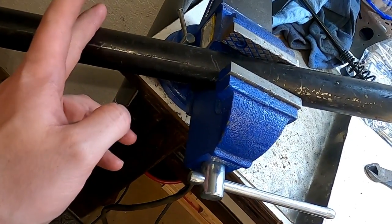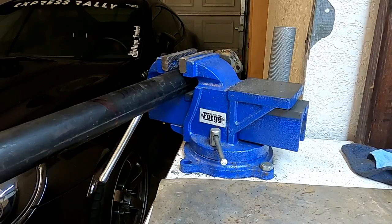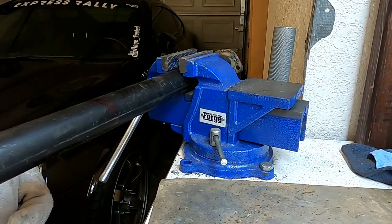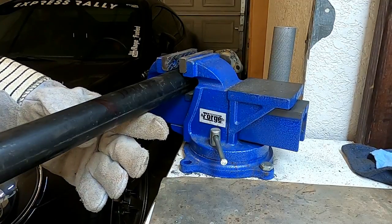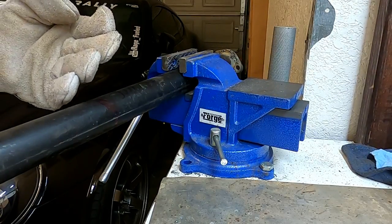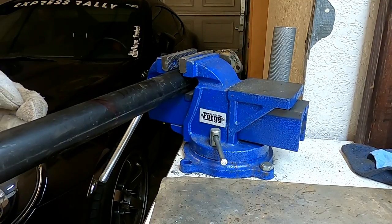Because I want to make a very industrial looking tip to it, we'll cut that off right about there. I've got my angle marked and I'm actually going to do a miter cut at about a 45 degree angle. Then I'm going to use my cut off wheel and make four or five pie cuts into the back side, all the way to the inside back of the pipe — I don't want to cut all the way through, but most of the way. I'm going to actually bend it down, and then weld each pie cut so it's not leaking. I want it to be like an angled miter cut.